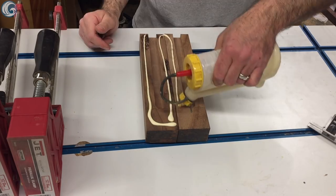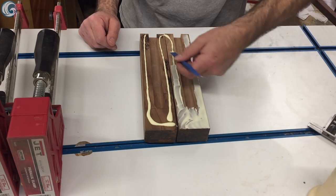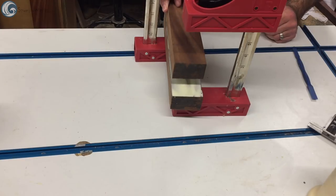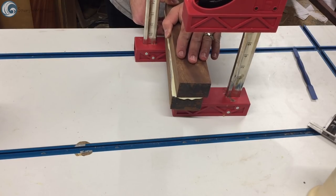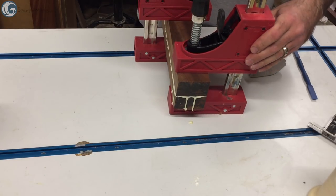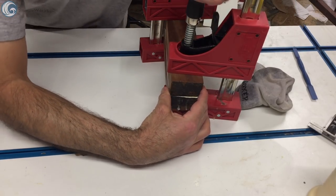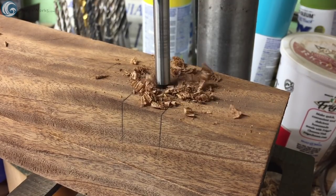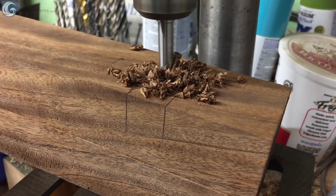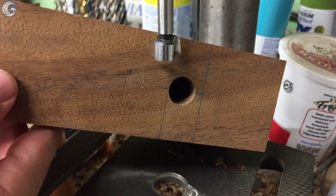While all the varnish is curing, I turned my attention to the spigot. I used a three-inch thick piece of mahogany, milled it square, and cut it into equal pieces. I routed a stopped groove to be three-quarters of an inch square when the pieces are glued together. This will allow the hose to pass into the spigot from the pump. When the glue is dried, I drill a 5/8-inch hole near the top at five degrees towards the bottom. 5/8 of an inch is just the right size for the half-inch copper pipe spout.